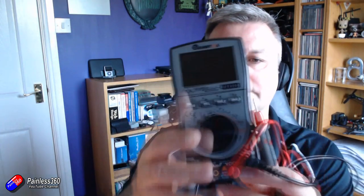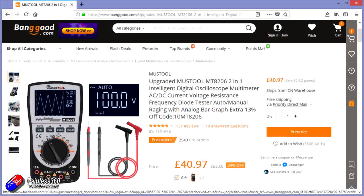This is my latest multimeter and the multimeter can do everything. It can measure voltage, it can measure resistance. This one is a little bit clever - it's my new one, and if I press and hold that button it's also kind of a mini oscilloscope as well. The oscilloscope in it isn't fantastic, but for a quick check to see whether or not I can see signals on particular pins, it's absolutely fine. I use them all the time in the hobby for checking continuity of wires, for making sure there aren't any shorts in the power plug before I plug a model in for the first time.